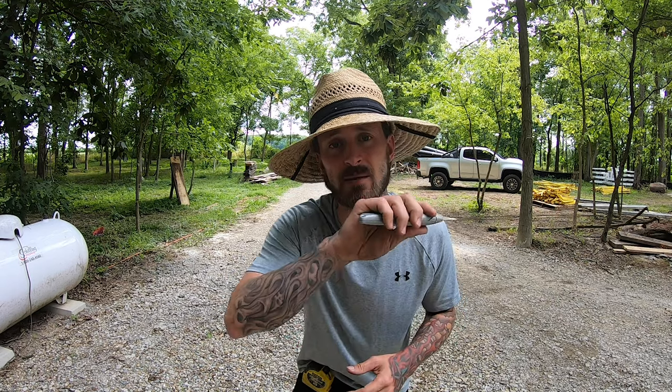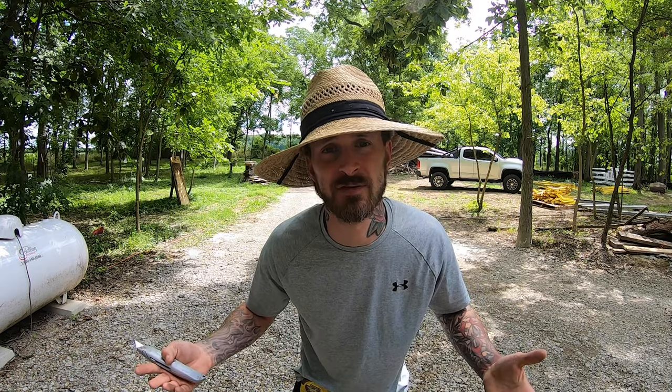All right, so first thing I'm gonna do, I decided that 5 foot is gonna be our mark. So I'm gonna go ahead and take one of these rolls, roll it out, measure 5 foot down from the top, and then I'm gonna go ahead and cut off, looks like about 2 foot 3 inches. So we're gonna do that, and then that's gonna be our height all the way around. Again, we are gonna waste some product, but it's cheaper to buy just 4 rolls of a 7 foot product than having to buy 8 rolls of a 4 foot product only to get that additional foot that I need to get up to the 5 foot mark.